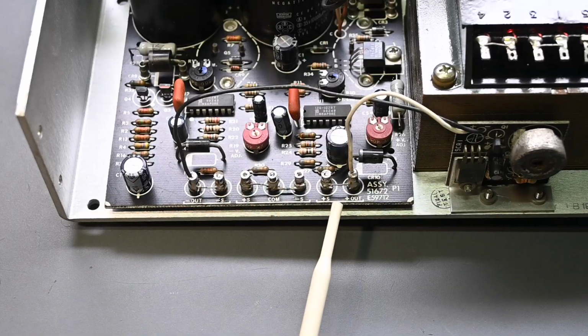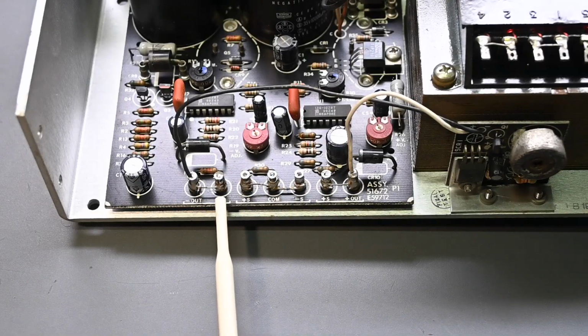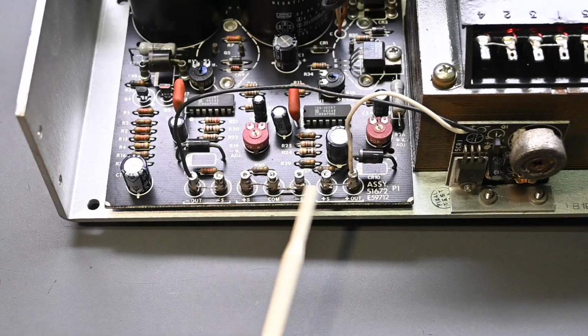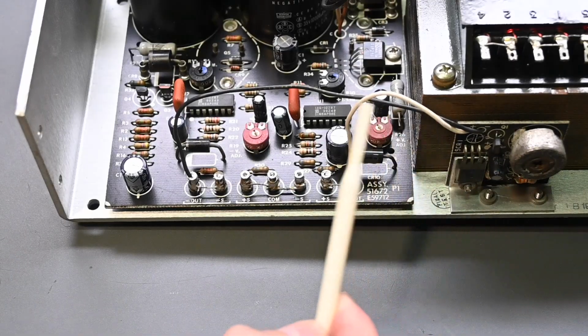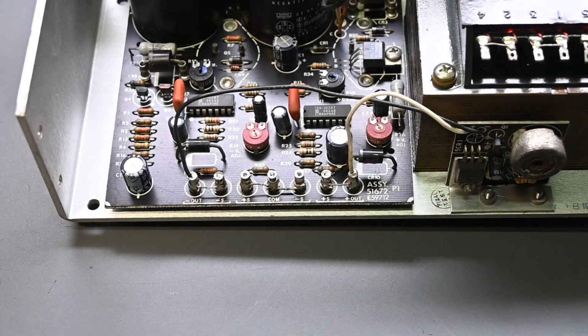And these other terminals that are marked as plus S and minus S, plus S and minus S, those are just remote voltage sensing terminals. They've already been jumpered over to the other terminals for local sensing, so we can just ignore those terminals for our purposes right now. And this circuit board right here with these 2 wires is just an overvoltage protection board. So if there's an overvoltage condition, it crowbars the output of the power supply. And this power supply is current limited, so if the output is short-circuited or crowbarred, it won't damage it.